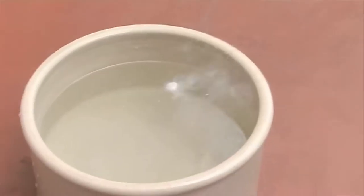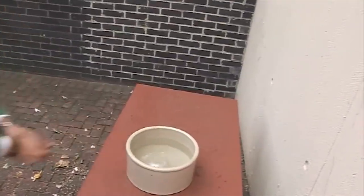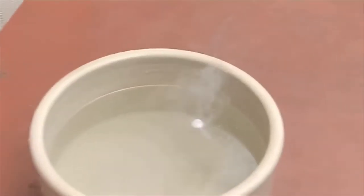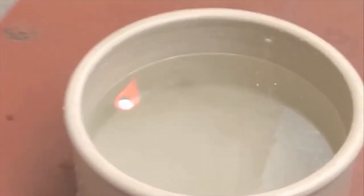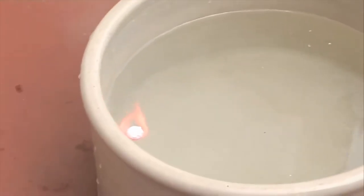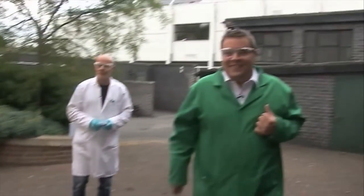What happens if there's a leak? Sodium reacts with air and water — but you haven't got air next to your sodium surfaces; it's inerted. With liquid metal fast breeders, the advantage of a coolant operating near atmospheric pressure must be weighed against the use of that same coolant, which also reacts rapidly with air at high temperature and violently with water at any temperature.